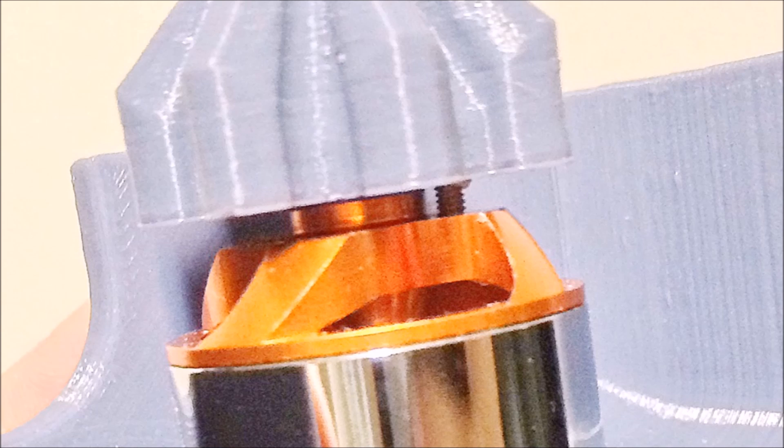To prevent the pinion from slipping, I attach a screw to the top of the rotating can and have a hole drilled at the base of the pinion to catch the head of that screw. Now there's no way the pinion could freewheel itself, even if it loses grip on the motor shaft.